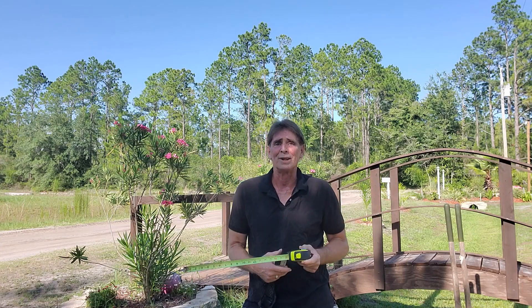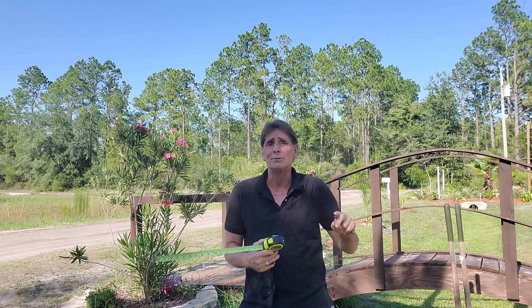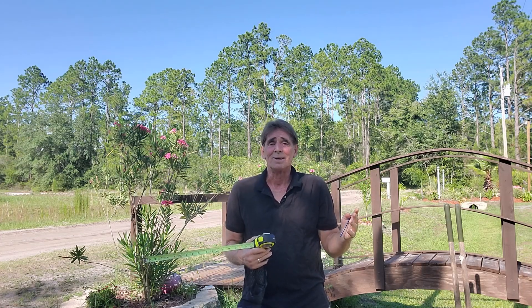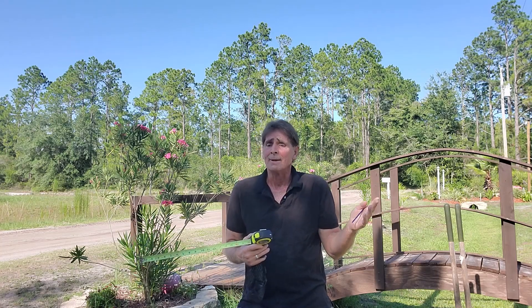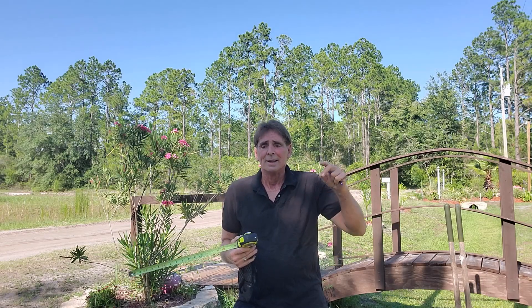And that's the level that you really need to put that French drain. So many questions about how much fall does a French drain need. If you've got a level yard and you're trying to move water, you're going to need a sump pump and you need to discharge to daylight — in other words, it needs to come out on top of the ground, out at a curb, or to a storm drain. If you're trying to lift water from the backyard and pump it around to the front yard putting it into a drain field, it's not going to work. You're just pushing that water back in a big circle and you'll end up with a flooded front yard. Remember, you've got to have a place for water to go.